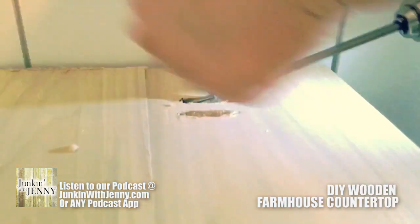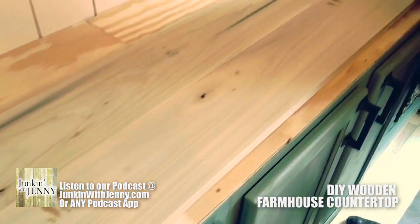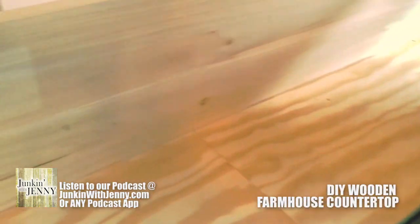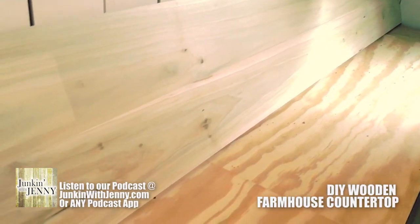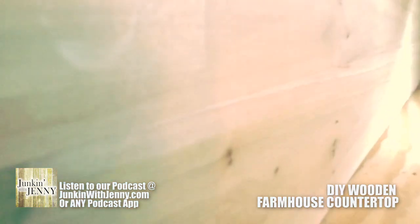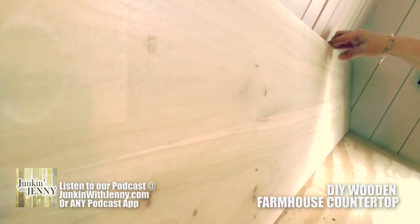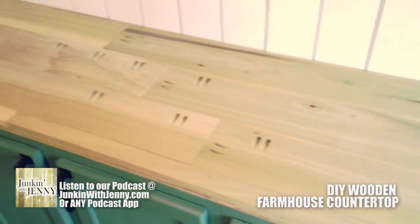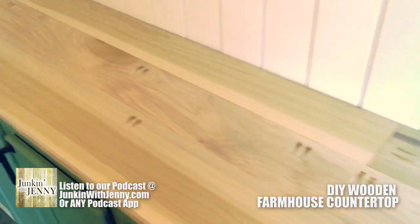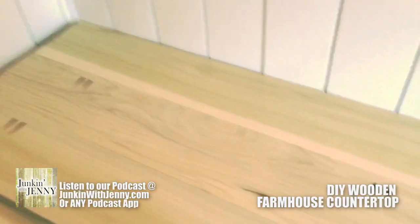This is the part of the countertop that's going to be facing the bottom — the part you're not going to see. And it just pulls all these pieces together real nicely. You pop it right up and it's now one piece of wood affixed together. We're going to do this for the entire countertop, so all of the pieces of poplar are going together using the Kreg jig through those pocket holes. As you can see, you end up getting a lot of pocket holes — you just work your way down until you have it all put together into one solid piece.